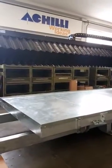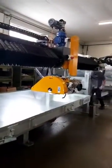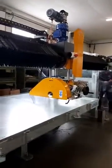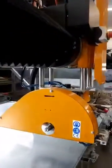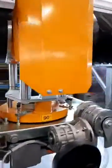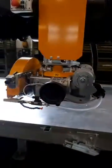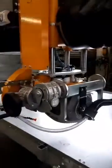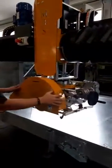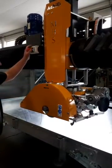On special order, the Y axis guides can be protected by bellows. Head rise and lower on the Z axis is on 4 chromed steel columns and a ball screw. The customer who purchased this machine was looking for a sturdy, entry-level bridge saw. He asked for a CNC 3-axis model with manual head rotation in 4 positions: 0, 90, 180, and 270 degrees, with hydraulic lock by push button, permitting the execution of straight cuts along the X and Y axis.